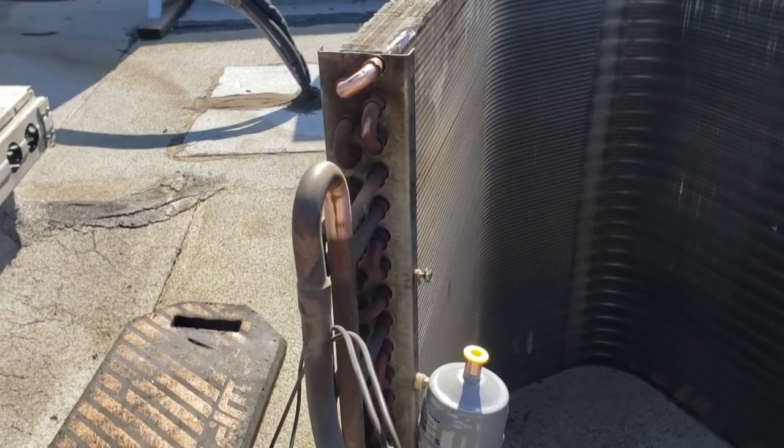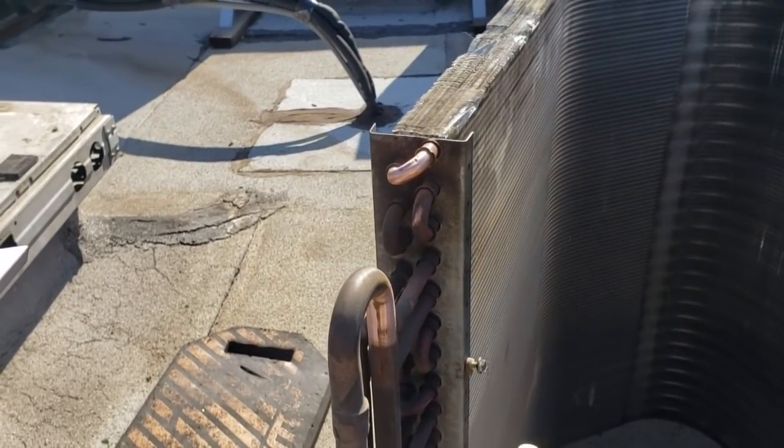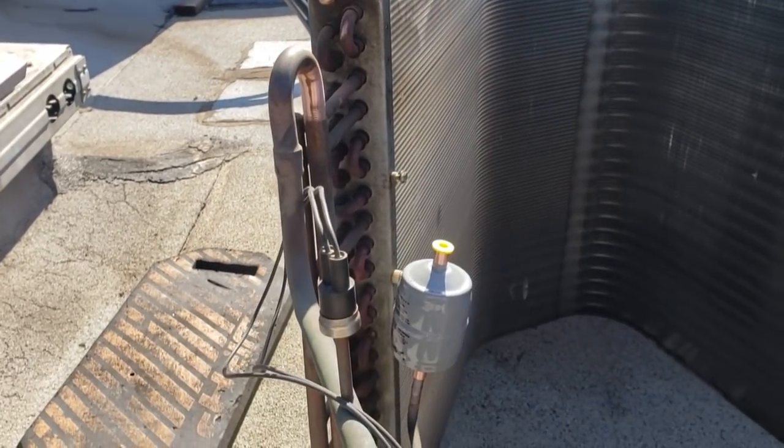The refrigerant leak was on this piece right here — it rubbed up against this right here. So we're going to go ahead and put a braze on that because it doesn't need to be replaced, I can fix that. There's another potential rub-out right here. Also I noticed that on this top U-bend it's kind of worn a little bit, so we're going to lay a bead on that and also on the back side. We're trying to take care of any potential leaks so we don't have these problems in the future. We'll lay those solder beads, get this condenser put back in, pressure test, and vacuum it down.